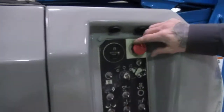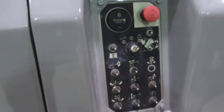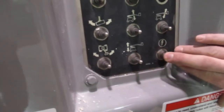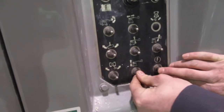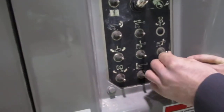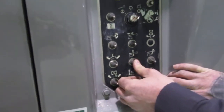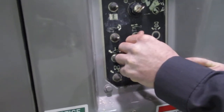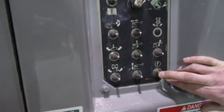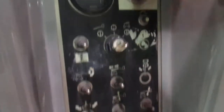On the ground controls here, you're going to have the E-stop with E-stop out, and key switch all the way to the right. You're going to be able to operate all your functions down below. This right here is your function enable switch — you always have to hit the function enable and then whatever function you need: secondary boom, turret, jib, primary boom up, down, basket rotate, extend, retract, and basket level. If for any reason the machine is stuck up in the air, you do have an auxiliary pump on this side. With the E-stop out and key switch all the way to the right, you hit your auxiliary pump and whatever function you need to get the machine down safely.